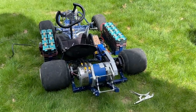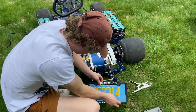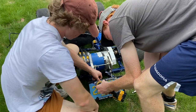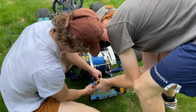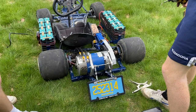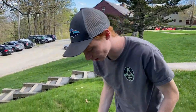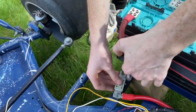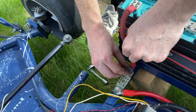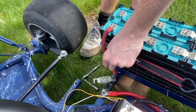License plate — almost forgot the most important part — back on! For the fuse connection, you just put it in like that, and hook that up last. Don't actually tighten it down — just swing it out so you can go like that to keep your fuse disconnected until you're ready.